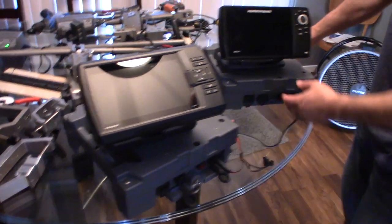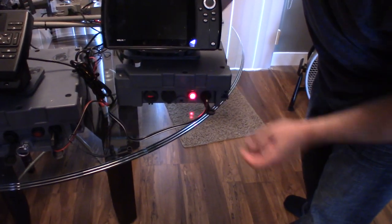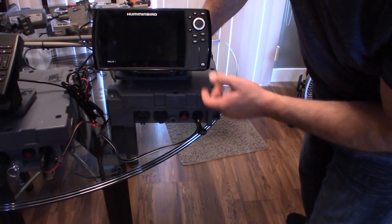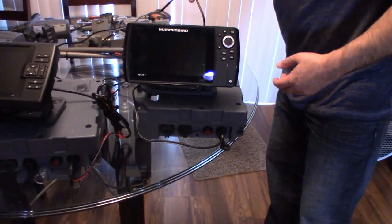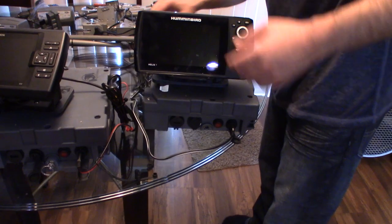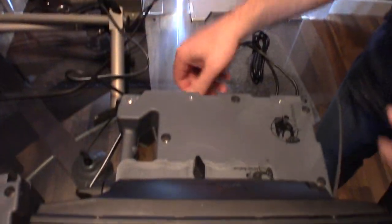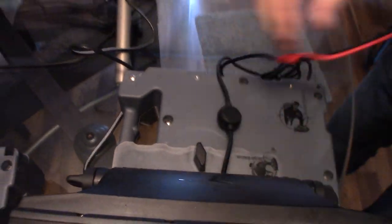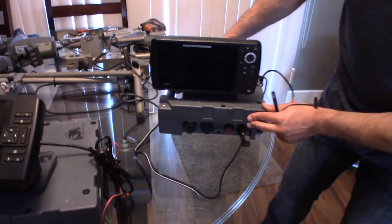So what makes one model unique from the other? In our conventional fish finder version, we can turn these on — there's power to these SAE connectors. Here's the Humminbird power cable as an example. I'll just connect it up. You can see there's a 20 amp hour battery — that's why we call it a 20 amp hour. It's a 20 amp hour, 12 volt battery. This over here is the charger — the green light is on showing it's charged, so we're going to disconnect the charger.